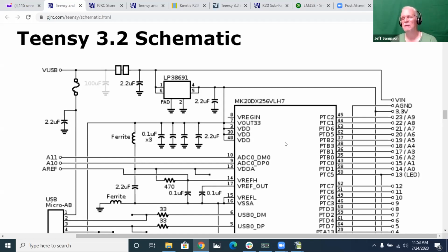But my thought was it could be that the reference is just noisy. Since the 2.5 volts I'm reading in and the signal from the gyroscope both basically look the same way, I'm thinking it's just that the A to D converter isn't working right.